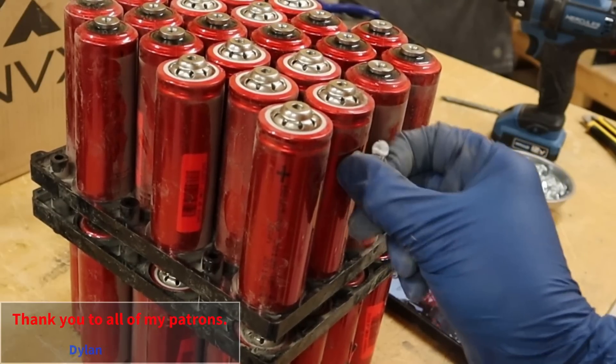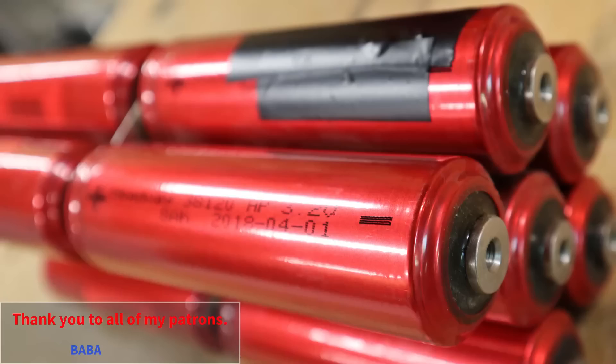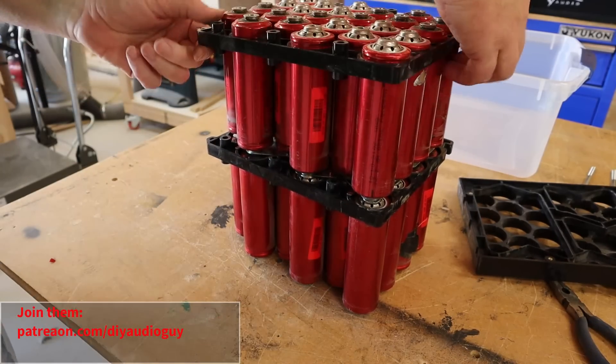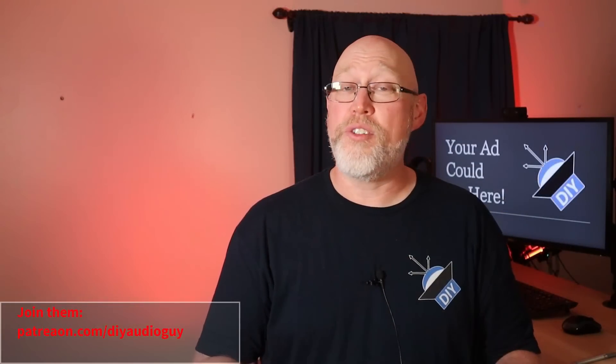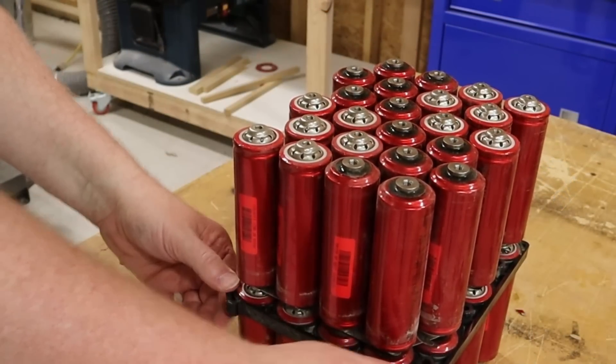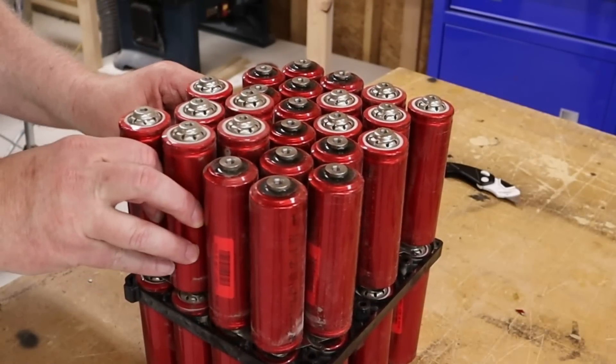At this point, remove these heat sensors if you have not already. You will damage that red outer cover when you do it, exposing the positively charged outer case — make sure you cover that with electrical tape. At this point you can remove one of the center spacers, then pull one of those cell packs out so that you can flip it over. Pay close attention to how this is oriented: I have the pack positioned so that the side with the tinned bus bars is facing up, and the top — the end with the handles — is nearest the camera. It's just a matter of sliding out this set of 12 cells.